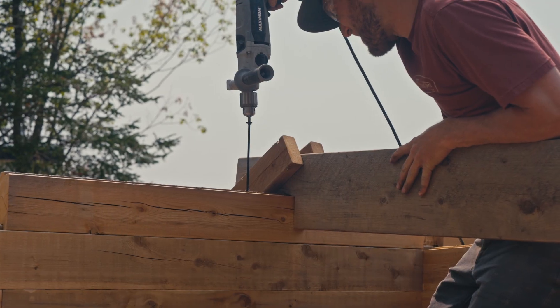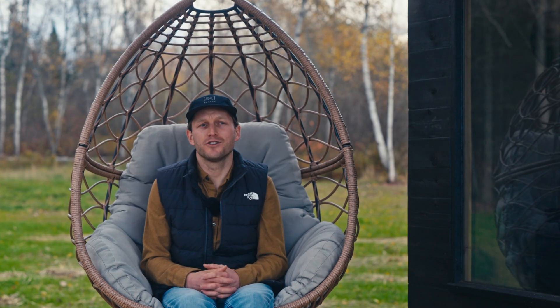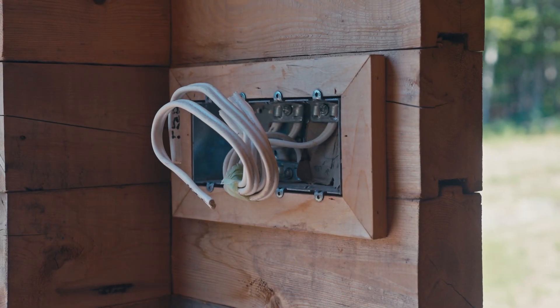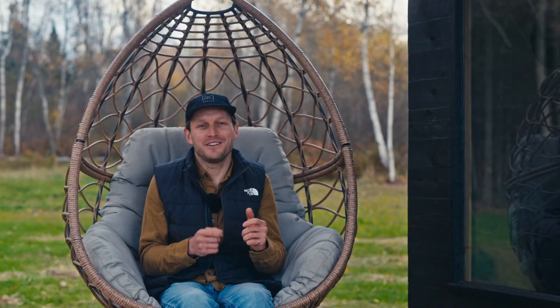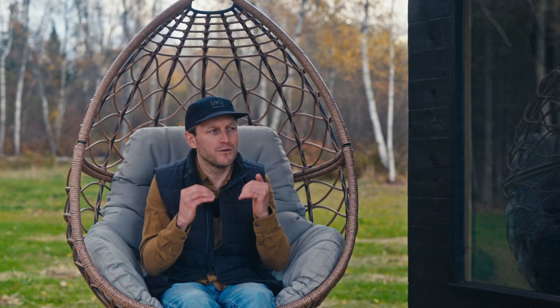The sauna is wired off the house and from there it's mostly conventional wiring. The challenge was more so in running the wires through the logs — it's not your conventional two-by-six walls where you can run a wire straight through and pull it back if it's short. I had to run the wires through each log as I went up with my rows of logs.